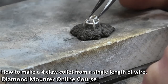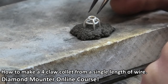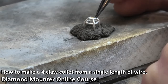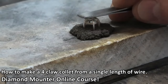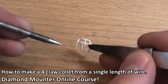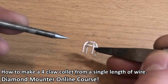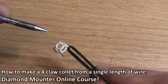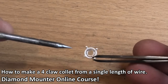Put it in there and make sure it's all sitting nicely — make adjustments if you need to. It should be sitting perfectly before you go to this stage. Make sure everything's done correctly. The only thing to do then is make sure it's flat and nice and parallel with the other one. Then, in more detail, get your loupe and look at every single join — make sure it's all flooded properly, that you haven't put too much solder on or not enough, and that solder hasn't flooded all over the metal. Just basically have a good look over the whole thing.